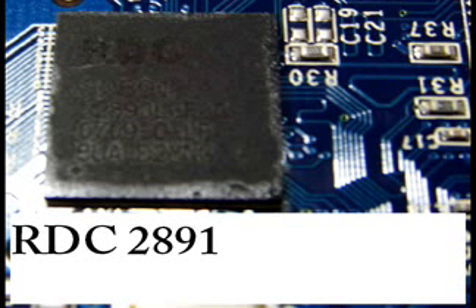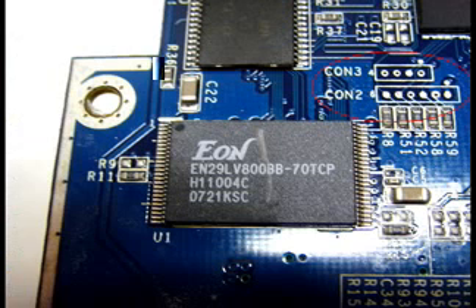I checked the hard drive for data — it has a FAT32 file system. Maybe you are looking for a board like this to make your own real-time operating system. Did you notice these connectors? These connectors may be related to JTAG. Originally I was looking for a serial interface to connect to the operating system. Maybe it's possible with these connectors, and maybe there's enough hardware to install BusyBox.